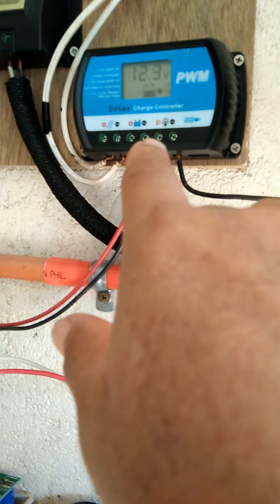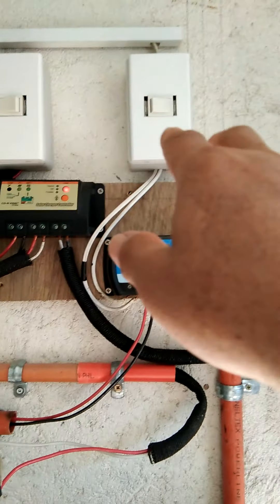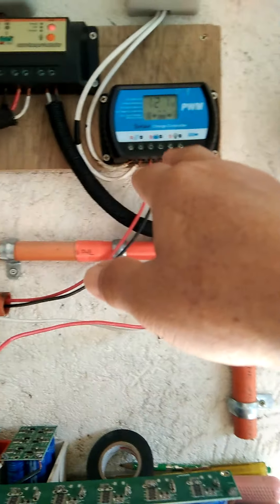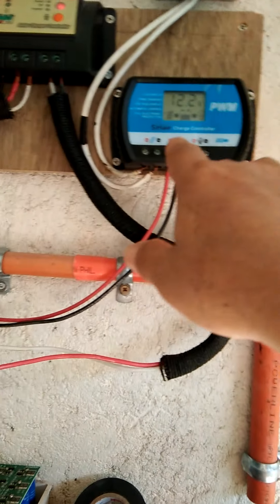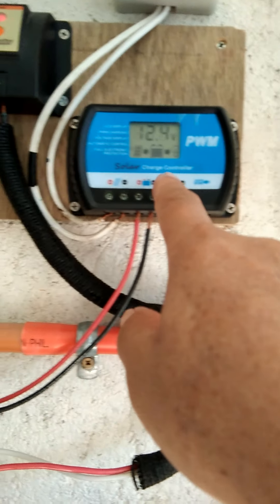Now I'm going to power up. The voltage is 12.3 volts already. I'm going to test the inverter. It's going to have a load — loaded already. Amen Lord, have mercy. Thank you Lord. Now I'm going to close the bypass switch number 2 to energize the supercapacitor again to store energy while at the same time there's a load, as shown here by the single line diagram. 12.3 volts right now.